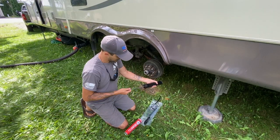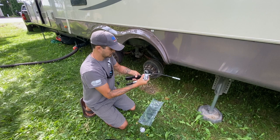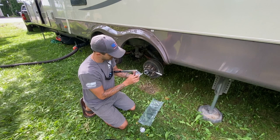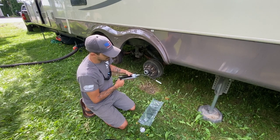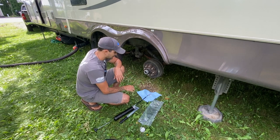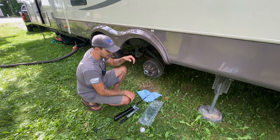Now we got our grease gun ready to go. We're going to fold this all the way back, get this open, and pop the top like a soda can. Now it's all on — I'm going to release that pressure. I think this has an automatic bleeder valve. Either way, what you want to do is pump the air out of the line, so you give it some pumps until you get grease. Now this is ready to go. I'm going to redo this bearing completely because that other grease was old — I don't really know how old it was. I'd rather just use all brand new stuff, and it's only $5 for a tube of grease, so I'd rather just repack the thing.